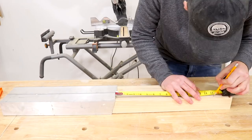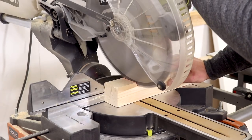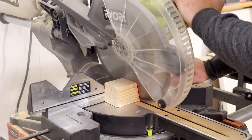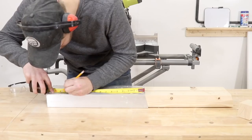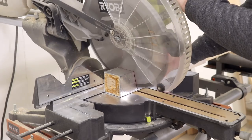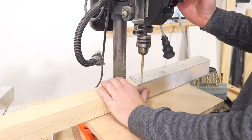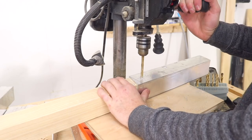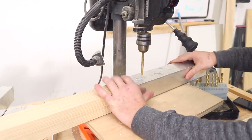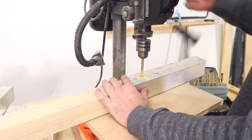The leg is a pretty basic 15-degree parallelogram, and from the center of the leg, which is the bottom of the aluminum, it's 15 inches to the bottom of the leg. And from that same point in the center of the leg, it is 15 inches to the top of the aluminum. Hope that makes sense. Overall, it's 30 inches. And while my legs were still individual pieces, I drilled the holes that the brass rods will be going through later. Of course, if you don't have a drill press, you could use a normal drill. This just helps to drill perfectly straight holes.